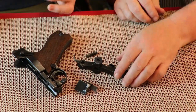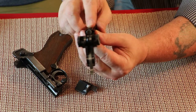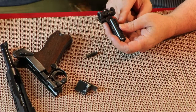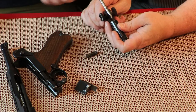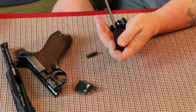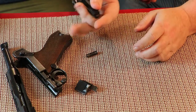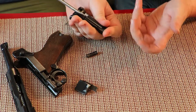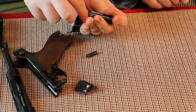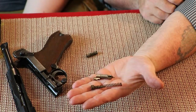That is your bolt and your barrel. You're going to look down through there and see if it's clean. See that screw right there? It's got to be pushed in and rotated counter-clockwise. Be careful because it's under extreme pressure. Push in on it and rotate it. I'm going to show you and then let you do it — push in and rotate. It's got a spring in there and it's going to fly out, so try to capture it. Just push in and rotate until it unlocks and starts coming out. Pull it out — that's the spring, and that's the firing pin.